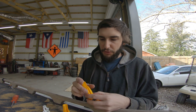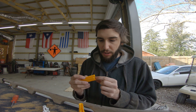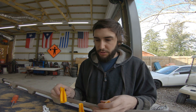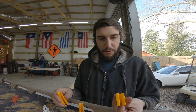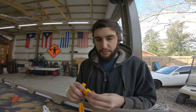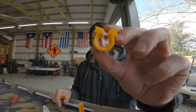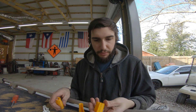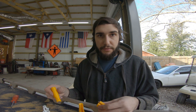You have to print them separately because if you do them all together, the 3D printer will go from one to the next and you won't end up with a continuous piece of material, which could potentially cause issues. So you print one, take it off, print the next one, take it off, then start the third print. There are other ways to do it but that's just the way we chose. There are still some little hairs in there when it prints that we need to clean out, but I think we've got the settings figured out enough where it'll work. We'll snap it all together and go from there.